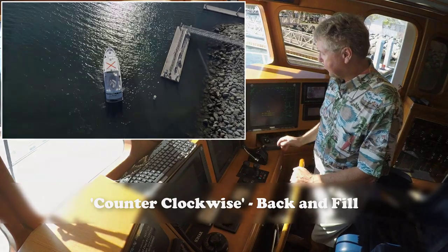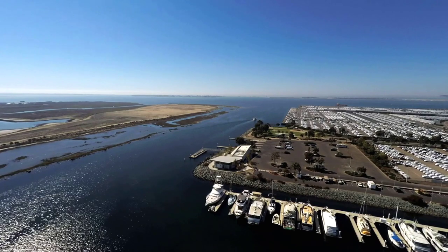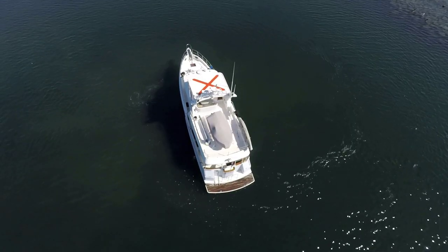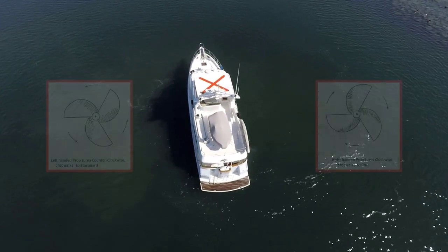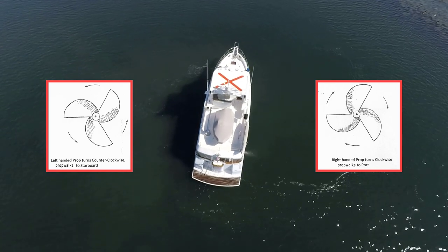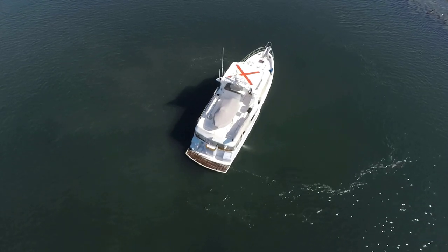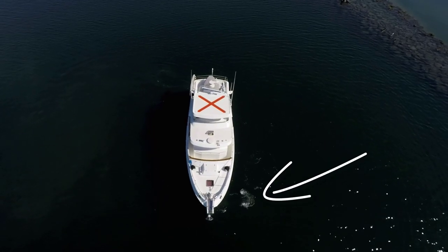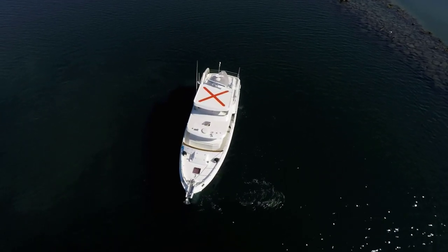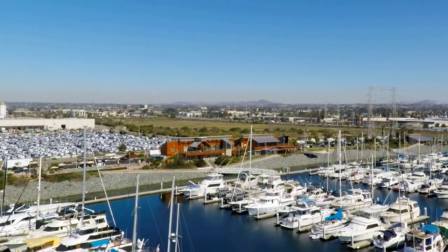We hope you'll find time soon to take your boat out in calm water with plenty of sea room and experiment with pivoting. Try pivoting in the direction aided by prop walk, then see what happens when you pivot in the opposite direction — you'll find the pivot is less effective when prop walk works against you. Then try adding the thrusters if you have them to see how it improves your performance. Once you're comfortable pivoting in open waters, try using the same technique in closer quarters.